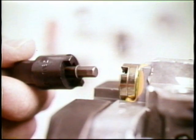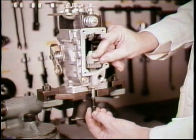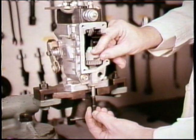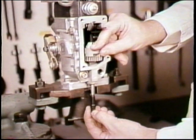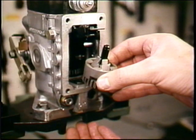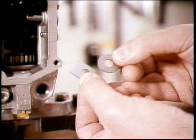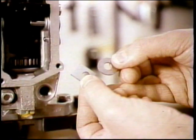After fitting the special governor shaft pin wrench you can remove the governor shaft lock nut. With the pump vertical, unscrew the governor shaft. Hold the flyweight carrier so it doesn't fall out. Now lift out the flyweight carrier assembly and set these parts on your shop rag. Finally remove the thrust washer and shim — that takes care of the governor.